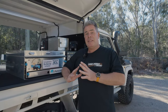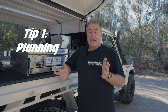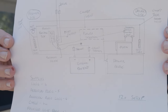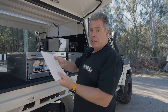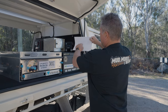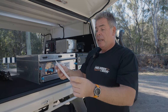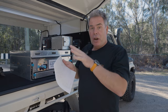The first essential thing you're going to need to do with any 12 volt build is plan out what you want. That is the most important part of the whole build. I've done that with this little piece of paper — I'll zoom in so you can have a look at it. There's the drawer fridge, the lithium battery, the control box, the shunt. That was my roadmap to make sure it all fits. So that's my first essential tip: you've got to make a plan.